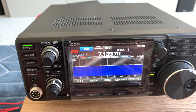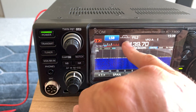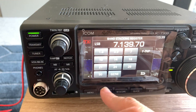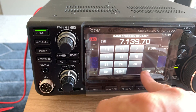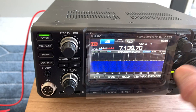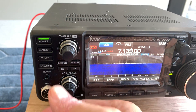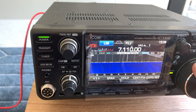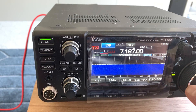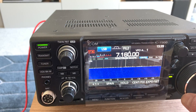Basically the way you can tune this: if you're on 7.1397 MHz and you hit the 7 MHz button, you get some shortcut buttons up here to go through to other bands, or you can key in a bit further and then fast or slow tune. Once you get used to it, it's very intuitive and easy to use.